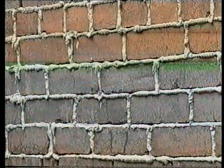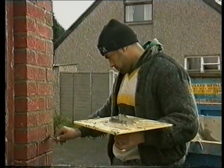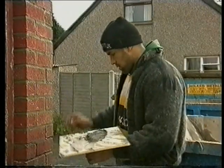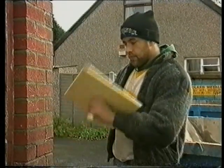It has taken only 4 minutes with very little effort to do all this work. By comparison, the handboard and trowel is a very slow means of pointing, particularly if there's a lot to do, and there usually is. It's hard work and tedious, but nevertheless there's plenty of work for anyone willing and able